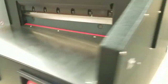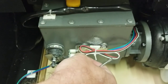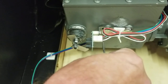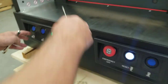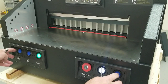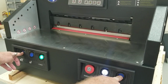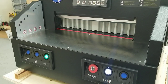Now let's plug it back in. If you're having that problem, a lot of times just unplugging it and plugging it back in — making sure these four wires aren't backing out — will fix it. Now it should do what it's supposed to again: stop for one second at the bottom. That's normal.